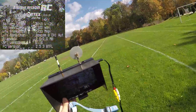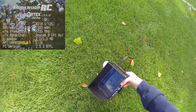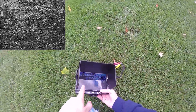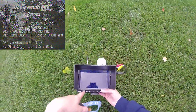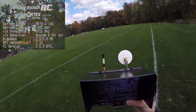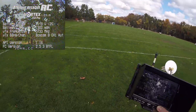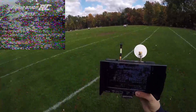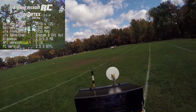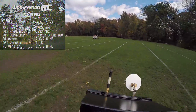I'm very happy with this monitor, especially because it doesn't seem to roll when there's bad signal. Watch this — I'm going to kill the signal purposefully now, and it's not rolling. By rolling, I mean the same picture will appear over and over again, which is terrible for racing — it will disorient you, and that's the best way to cause a crash. Another problem is a monitor that gives you a blue screen — you don't want a blue screen, you want snow. Luckily this monitor does it perfectly: it gives you snow and no rolling.